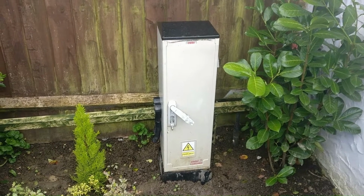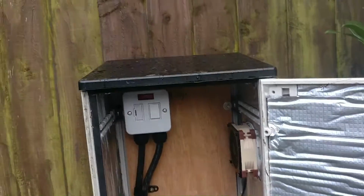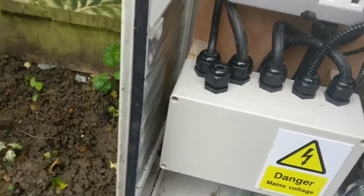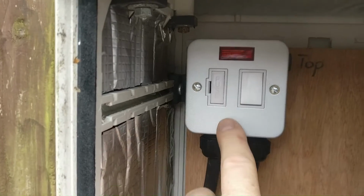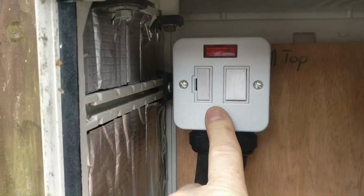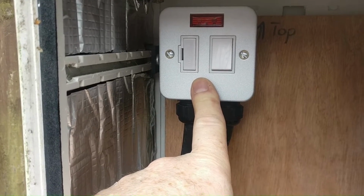Okay, so I'm going to install my outside socket. I've already run a power supply from my outside electrical cabinet. So I've got a 240 volt supply here, which comes from the internal consumer unit. I've taken that to a 13 amp switch spur. I've done a video for that already, how to wire that. I'll put that in the link below.